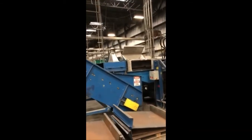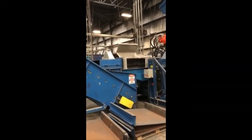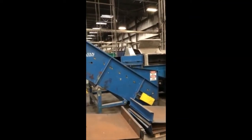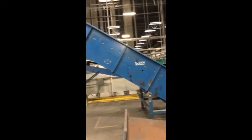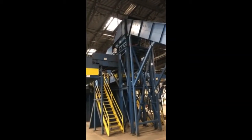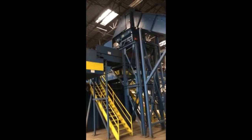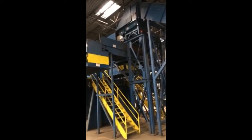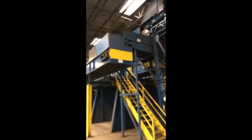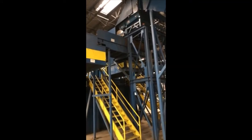There's a shaker conveyor coming out of the SSI shredder that had a screen in it that removed the minus 3/4 inch material and took it around the picking platform, but then the plus 3/4 inch material, which typically was plus 3/4 inch all the way up to about 7 inch, went up to a picking platform and hit a drum magnet initially. The drum magnet took the magnetic materials and moved them down this conveyor line, whereas the non-magnetic materials went down the primary conveyor line.